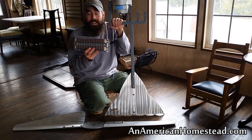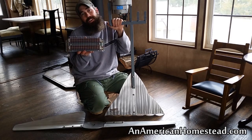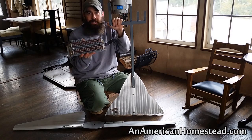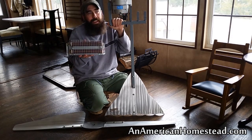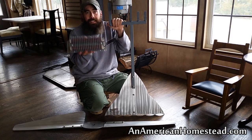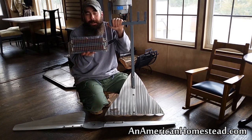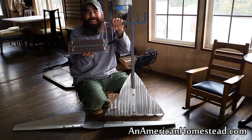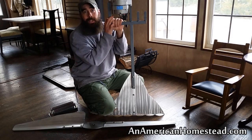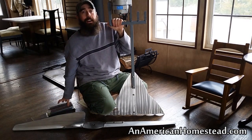This bank of resistors was purchased from Missouri Wind and Solar. Once that extra energy gets diverted off the battery banks, it's going to go into these resistors and produce heat — which is very convenient in the wintertime. We're going to mount these in our office trailer that we use to work on our laptops, giving us a heated office. We're going to mount this less than five feet away from the battery box inside the trailer, wired directly to DC power. Unless you have a specific wind turbine like the Primus Air 40, you will need a dump load for your wind turbine.